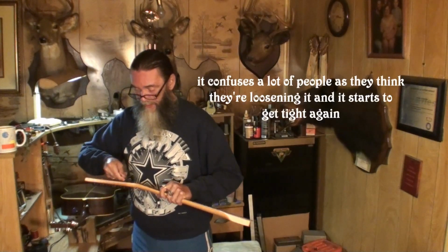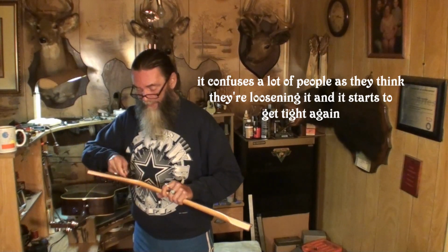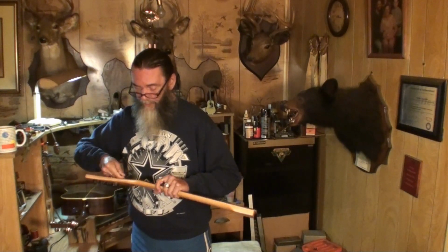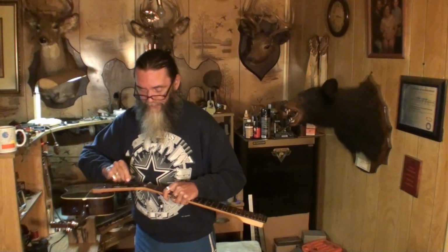But like I say, if it's a two-way adjustable rod, you can't screw the adjusting head off. Try to get a couple of drops of oil on the threads though. Usually sometimes you can see the threads down in there. One drop of oil, man. WD-40, it don't last, it's thin, and it'll run down in there. It's good for breaking them loose if they're seized up or stuck. But you need a little heavier oil on there to actually lubricate it. 3-in-1 oil is fine. I've even went as far as to use car oil before. 10W30, man. 20W50, there it is.